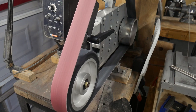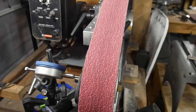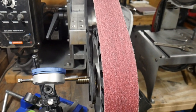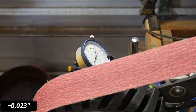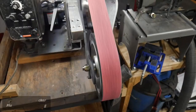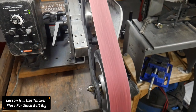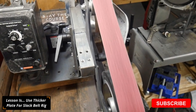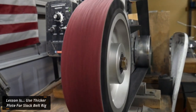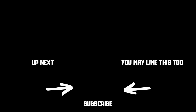Just for fun, I drilled and tapped a quarter-20 hole for my large contact wheel on the bottom of this attachment, and by raising that location I was able to get the flex down to around 23 thousandths. All in all it will get the job done, but if you're going to do this yourself, make sure you use a thicker piece of plate. Too much flex can cause uneven wheel wear and tracking issues. If you liked this quick tip video, please hit the like button and consider subscribing — until next time, catch y'all on the flip side.